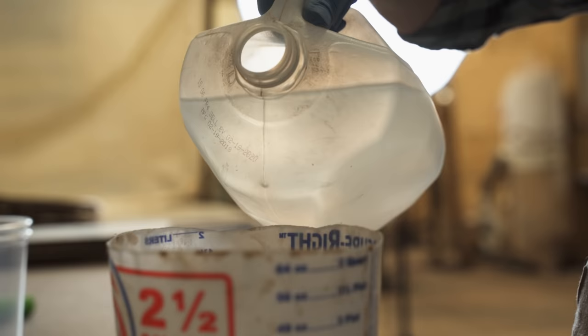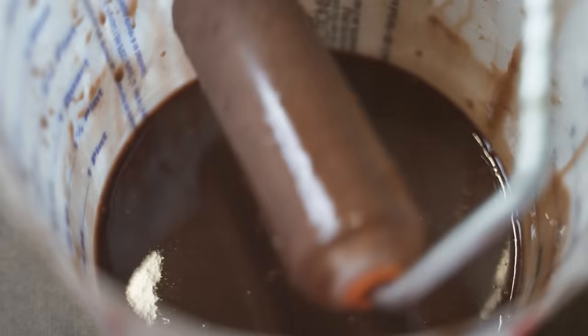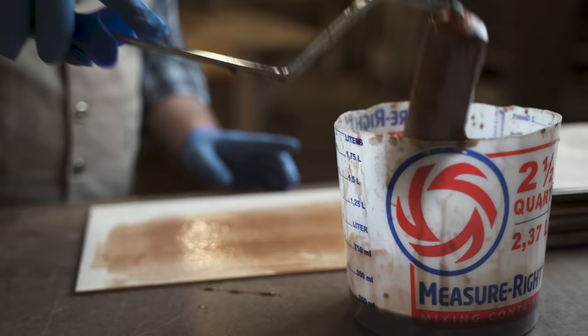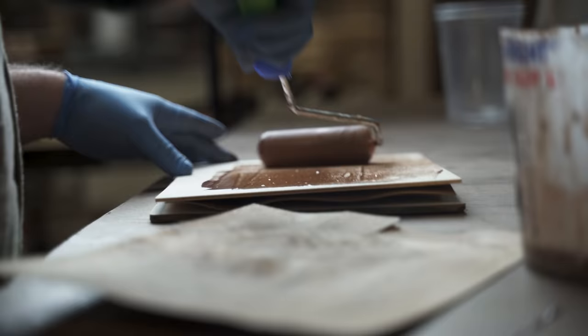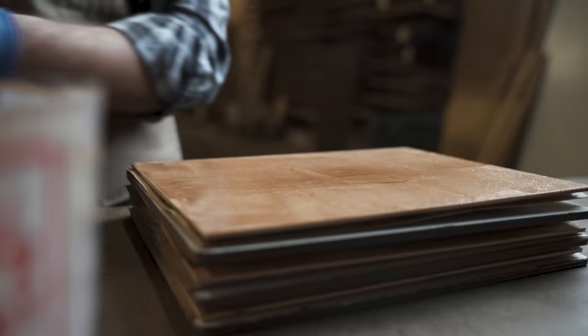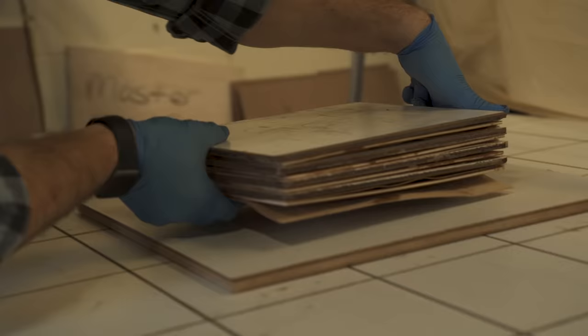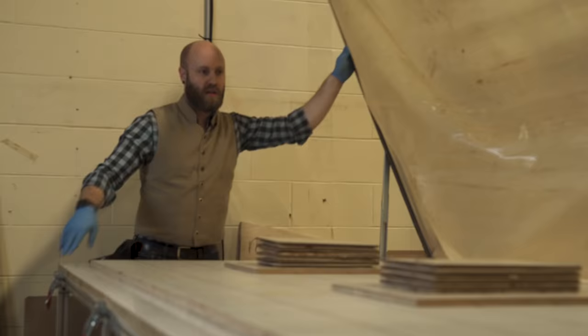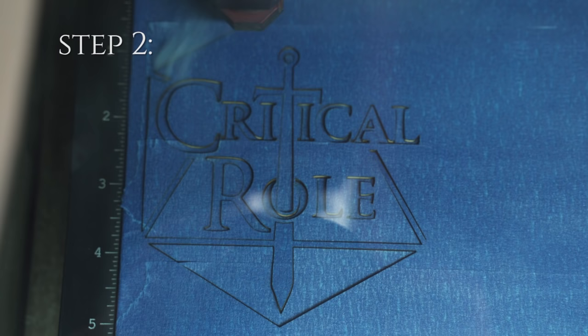This glue that we use is a two-part mix, and you just have to make sure that the water-to-glue ratio is correct. Here we're just spreading the glue on the plywood, stacking it up with the veneer, and then you'll see me put it into the veneer press, which is basically a big plastic bag with a vacuum on it. We leave it in there for about three hours, and that gives the clamping pressure to glue the panels together.